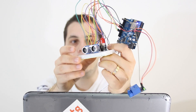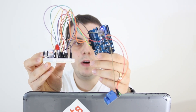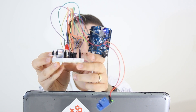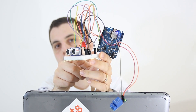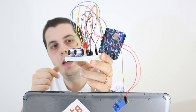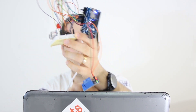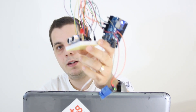This is how the system will look like. We have an Arduino Wemos D1 board, which is an Arduino replica but with ESP8266 Wi-Fi connection. We also have an ultrasonic sensor that's going to detect if someone enters your home, a push button, a LED light, a small buzzer, and finally a relay that's going to control our big siren.